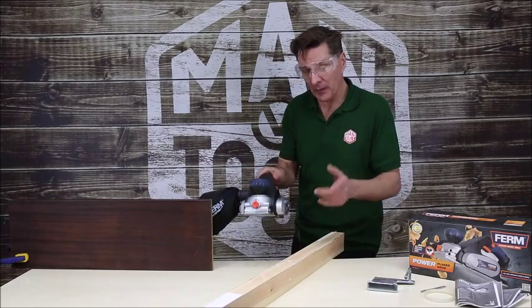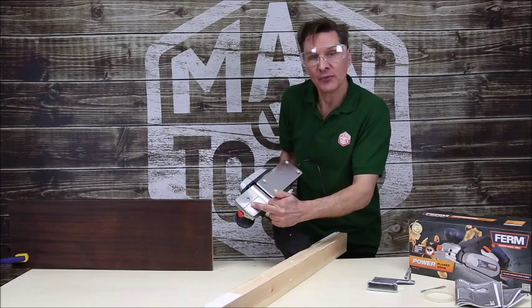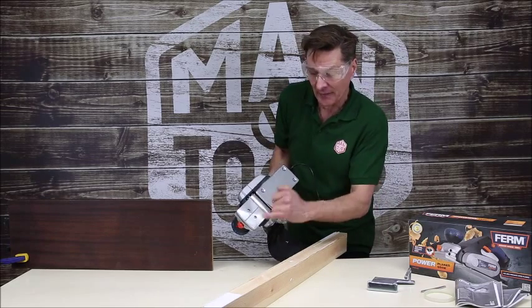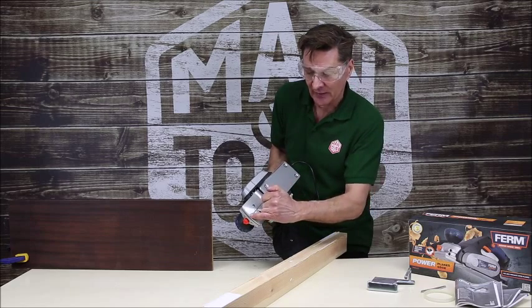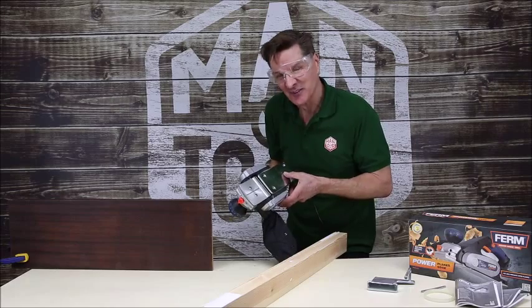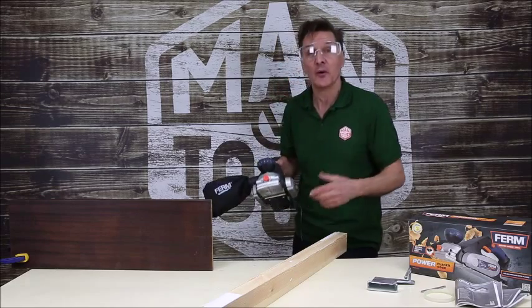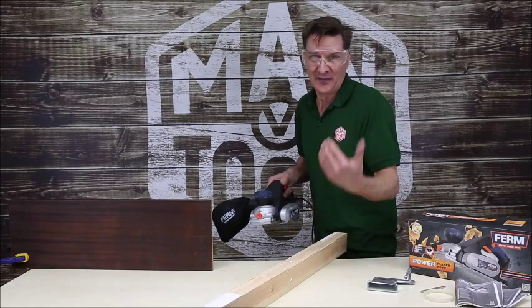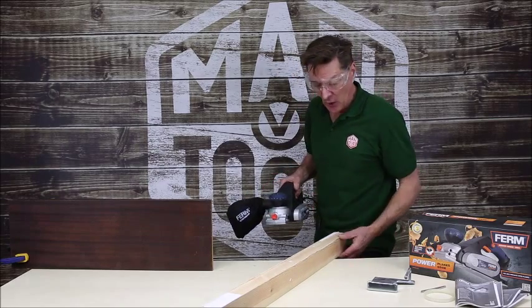If we look at the sole plate, if you're not sure what the sole plate is, it's the front toe plate. This one here, okay? This is the sole plate, this toe plate. And if you can see, it's got a little ridge in there. Can you see that? Any ideas what that's for? I can see you all smiling, saying, of course we know what that's for, Andrew. Everybody knows what that's for. Well, of course, you're absolutely right. It's for putting a chamfer, a bevel, or another word, de-arrasing, if you wish, on timber.